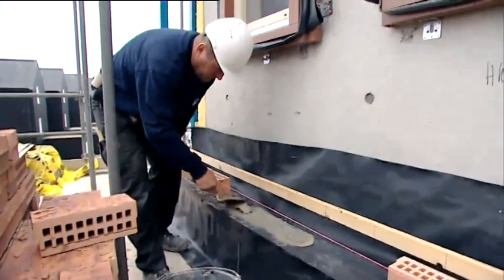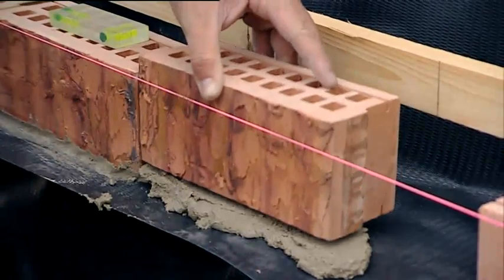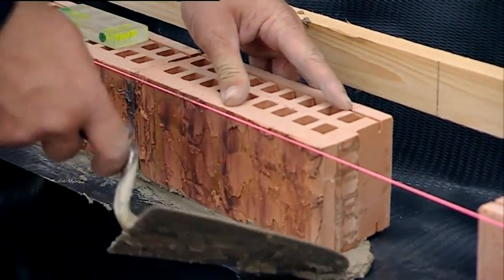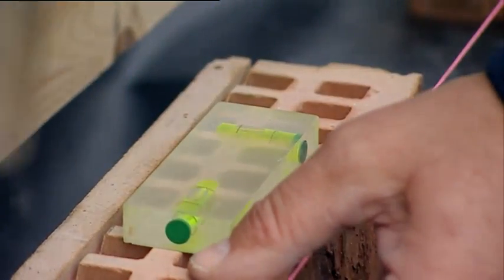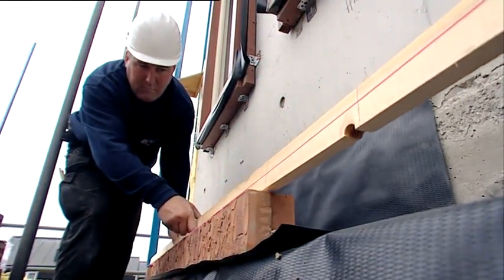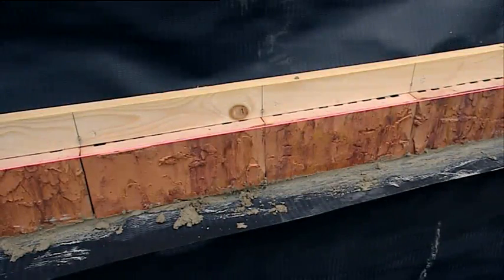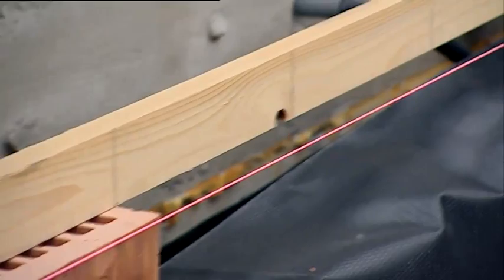One makes or breaks the Daas ClickBrick system by starting out with correct measurements. A perfectly implemented kicker course prevents discrepancies in height and width. The kicker course should be constructed from click bricks that are placed in mortar according to the modular specification. A handy aid in laying out the kicker course is the so-called header slat. One can make this by measuring out a 24 cm section on a long, straight slat.